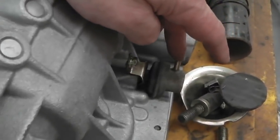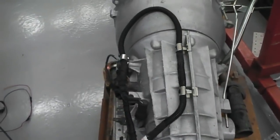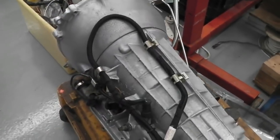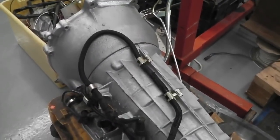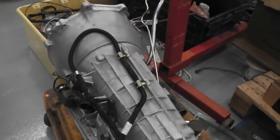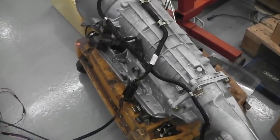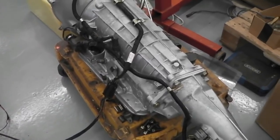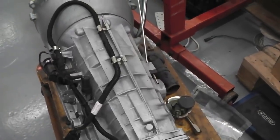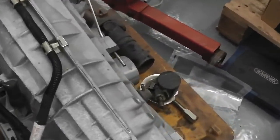There it is. So with a little bit of research, we find that vacuum pressure varies under certain conditions of driving, and indeed that will be why you can get those dash mounted old school vacuum gauges that show you some form of economy. Smiths used to do one, if you remember, green, orange, yellow sort of banding dial face on it, small little Smiths gauge. I used to have one on my Escort van. So vacuum is varying under different conditions, and they've used this sort of effect to change the gears with this modulator.